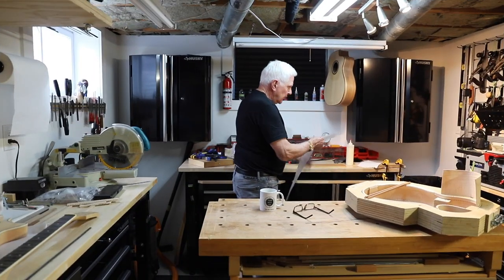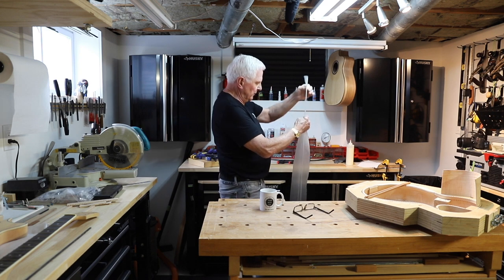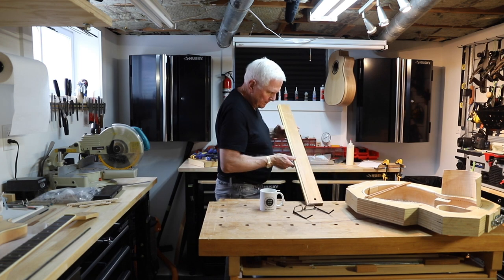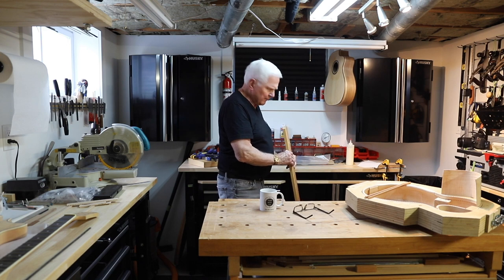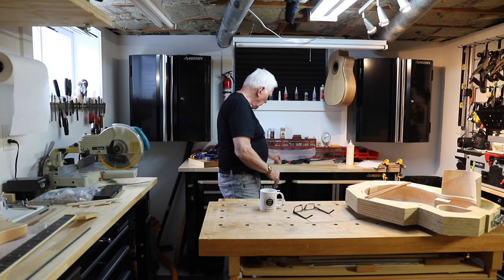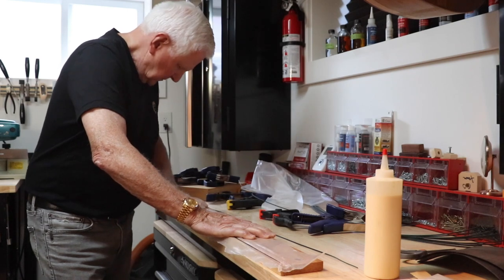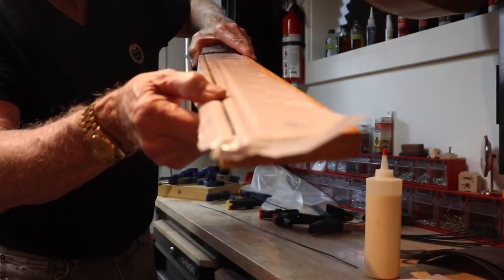First thing you do is you cut a long piece of wax paper. When you have the wax paper, fold it and then just set it over here. Remember, this jig is simply run through a table saw where it has the saw part way through — it's down about a quarter of an inch or so. You need it to protrude a bit so that when you put the actual binding in, it will sit like this and then when the clamp is on here it will hold it all down in place.